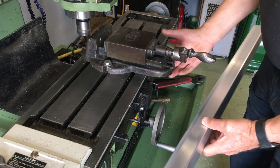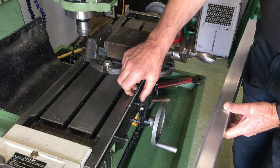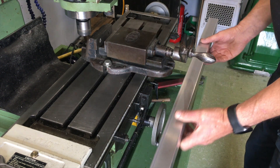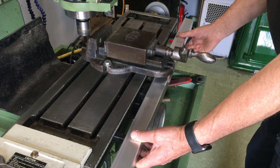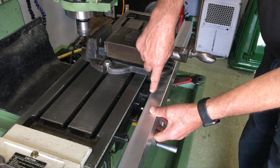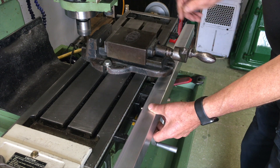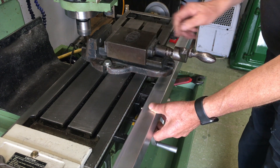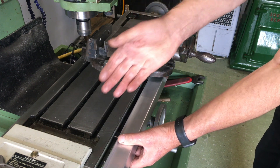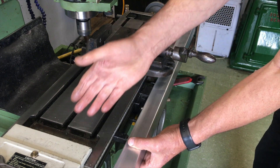As you can see I'm about to start fitting the X scale. The same sort of issues occur here as did on the lathe, insofar as that I can fit the scale to the back of the table but that restricts the Y slide movement by as much as 45 millimetres, and that's not an option for me. Fitting the scale to the front of the table also carries its own problems, like having a traverse motor that requires that adjustable stops and a pickup remain in place and that the handwheel must be accessible at all times.